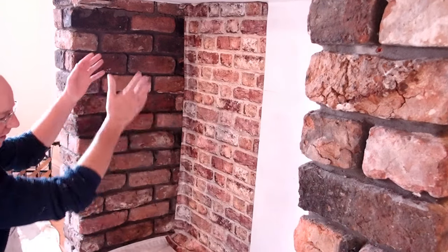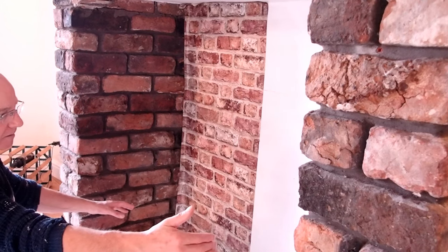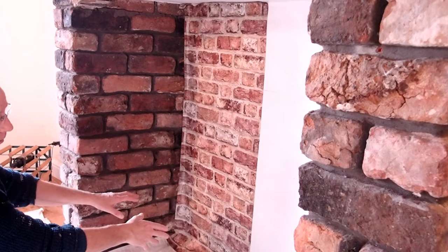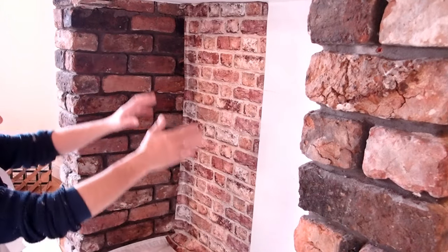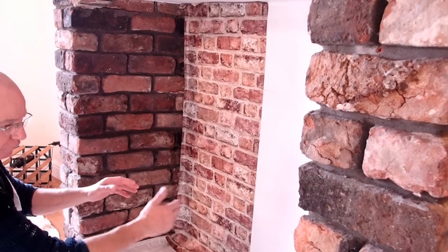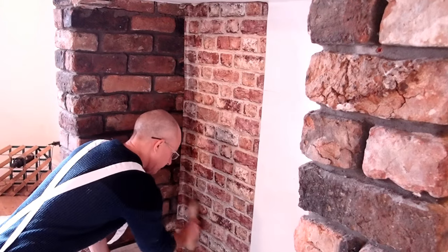When you're papering, that last bit is crucial for your next lengths. It's all got to be plumb, because if you rush that bottom bit, you'll put a piece on at the top and then you've stretched or pushed the bottom bit slightly. So then you're running out constantly up the wall. So careful with that.